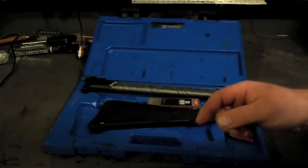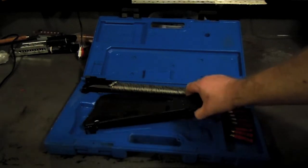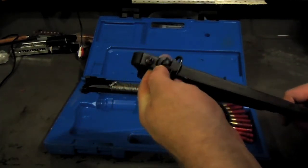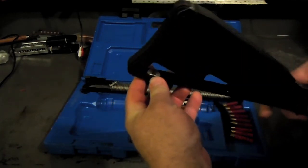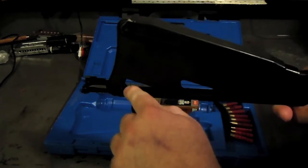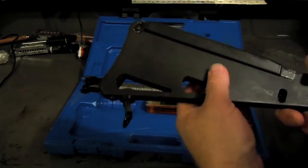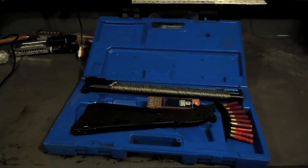What I did is I bought a sling swivel adapter for an AR-15. It just screws into the hand guards right through one of the holes. So all I did was drill a hole through the center of my buttstock, put the adapter plate in with the little screw, and screwed it in. Now I've got a sling swivel for my M6.